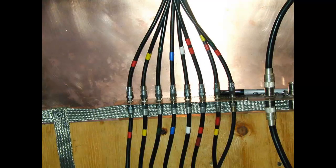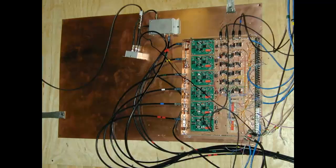These cables eventually come in to a box that multiplexes any antenna. I can pick any antenna in any direction on up to four different receivers at the same time. So I can receive on a northeast-southwest beverage. I can have one receiver receiving northeast, the other receiving southwest, at the same time, or I can have all four receivers on the very same antenna in the same direction at the same time. So it's really like having all these antenna systems independently available to four different channels.